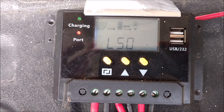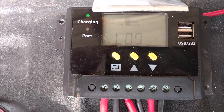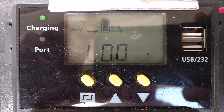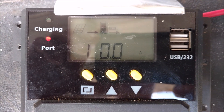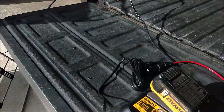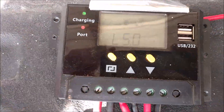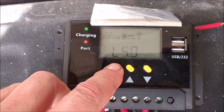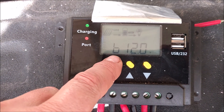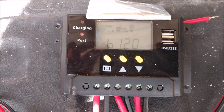Check this out — I turned the solar panels away from the sun. On this solar charger, I got it set at 12 volts and it just turns off the load. The load is zero; the DeWalt charger isn't charging the battery. Then I turned the solar panels back into the sun — I got some good sun now peeking through — and bing, bing, bing, boom, there it goes, it's charging. It's using about 5 amps. Battery voltage is sitting at 12, so 5 times 12 is 60 watts. But it's charging and the battery voltage is going up.